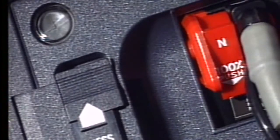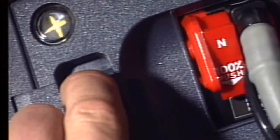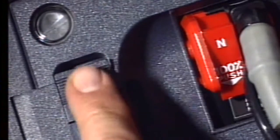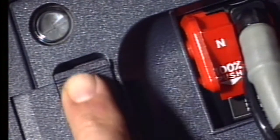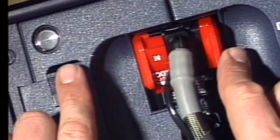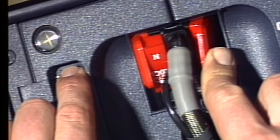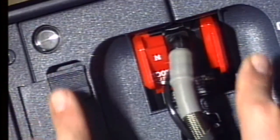In-situ testing. Push the reset test slider — the blinker turns yellow and goes black again, showing that the regulator is leak tight. Then press the harness inflation control — the blinker turns yellow and goes black again, showing that the harness is leak tight.